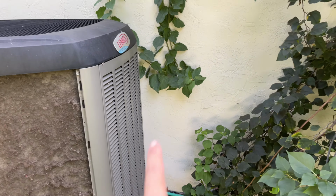And obviously, as you can see, it didn't do a super fantastic job. Some wet hair is still trapped in here, but that's okay. Most hair is gone, so it can at least breathe, I would say 80-90% better. So make sure you don't waste your money on the foam cleaners. Just use your spray hose, a fan-shaped jet shooting downwards at an angle, and push the dirt from the top to the bottom, and it's actually gonna come out from the bottom very, very easily.